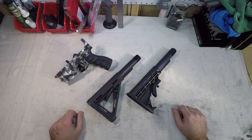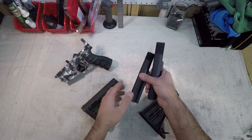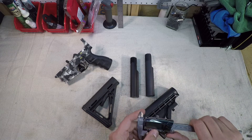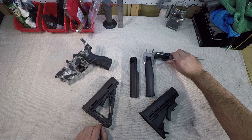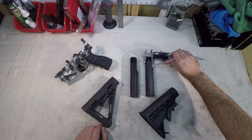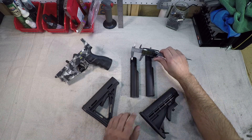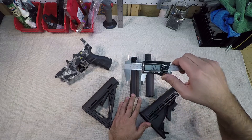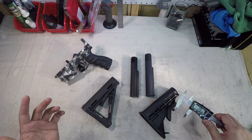So what's the difference between the two really? Essentially it's just the size. The commercial buffer is thicker in terms of diameter than the mil spec. We'll do this in millimeters because it's going to give a better reading. The commercial comes in at about 29.85 millimeters, while the mil spec will come in at 28.58. And that's essentially it — so what's the big deal, like who cares about one millimeter, right? Wrong.